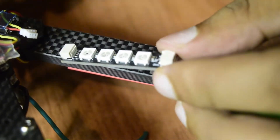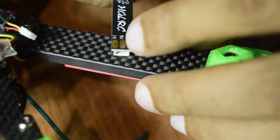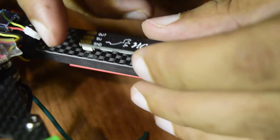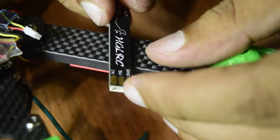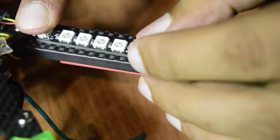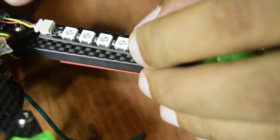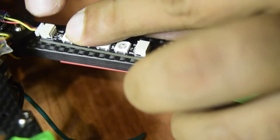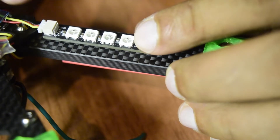Now let's connect the LED strip onto the jumper cable on each arm. Before you install the LED strip, ensure that you are connecting the jumper cable onto the inward port of the LED strip. Do not connect it to the outward port - it is not going to work. Ensure that whenever you install the LED strip you are installing it in the correct direction. Push it into the port and connect the jumper cable all the way through. This is your first LED connection and this is how it is going to be placed on your drone arm.